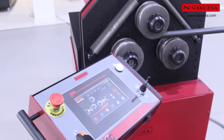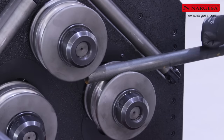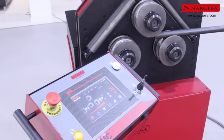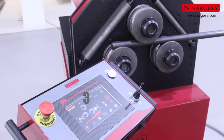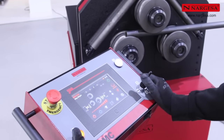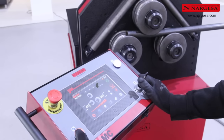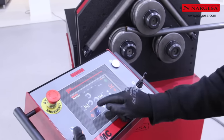When bending a pipe with welding, the seam must be placed at the front or back, but never at the top or bottom, as it could alter the dimensions of the bend radius. Clamp the pipe and place it in a position to begin the work. Position the roller at the reference elevation to create the desired radius and begin creating another piece in spiral again.